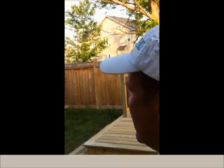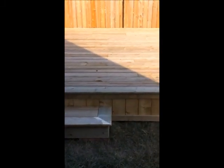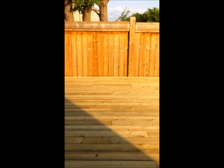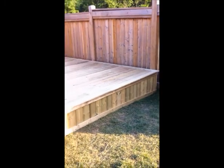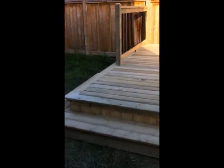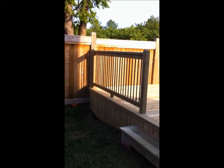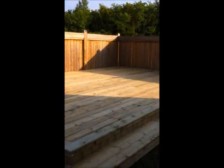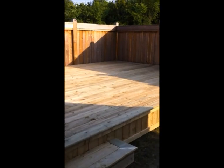Alright, Steven back here — we've wrapped it up. We've got all the decking on, the rails on, and the steps finished. It wraps around with a nice big 14-inch step so people don't slip off a short step. The access panel is in, skirting is done all the way around, looks nice and closed in. We used nice aluminum balusters for the railing — that's a nice touch. Thanks for watching Finish That Space. Visit us at www.finishthatspace.com.